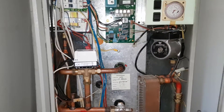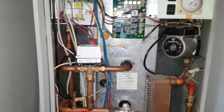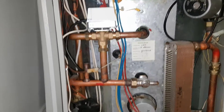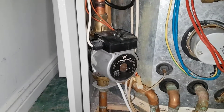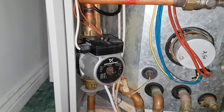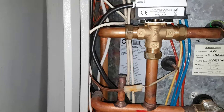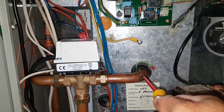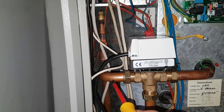The A Class is the latest range of appliance that they made at this time. This particular one has a diverter valve, which you can see here. Down here is the primary pump, and that pump circulates between here and the gas boiler downstairs. Its sole purpose is to bring the primary water from the boiler up through the pump, where this side goes to the primary store and this side goes to the radiators for central heating.